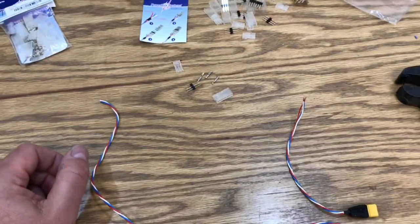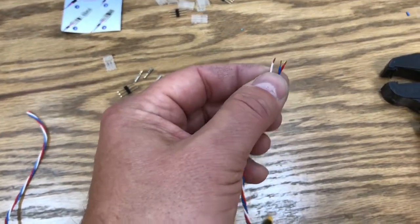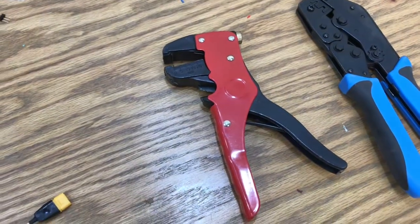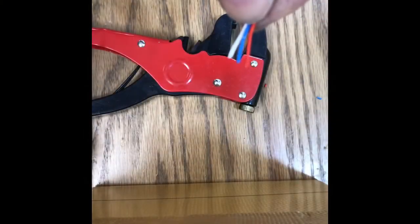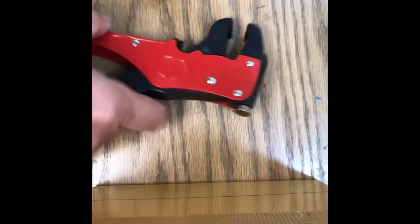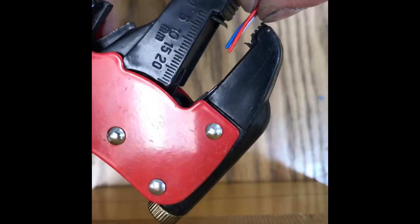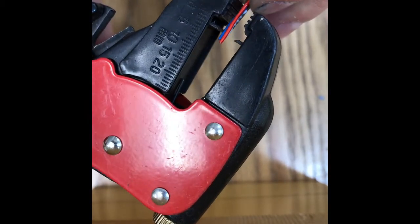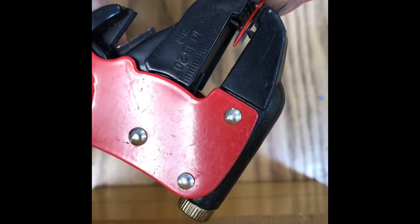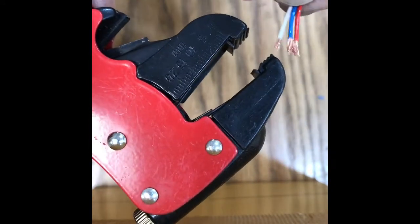I've already gone and cut the ends off. Some simple things to make it really quick: you really only need about three millimeters, which is like three-sixteenths or just over an eighth of an inch of wire at the ends. I like this type of wire stripper for this because I can do all three wires at one time. Here's the wires flattened out — you can see the twisted piece behind it. You just want to pull it flat so you can get these together. Push them into where it's about five millimeters in, which will pull some of the insulation back so it'll be about three millimeters. Push them in the jaws and pull it real fast and clean — all three right off.